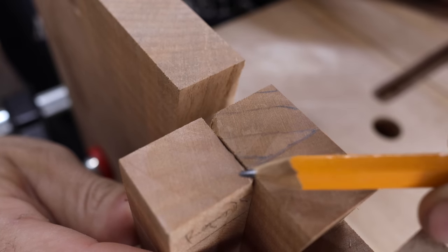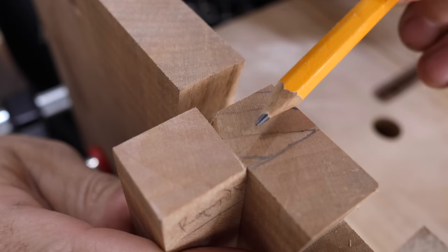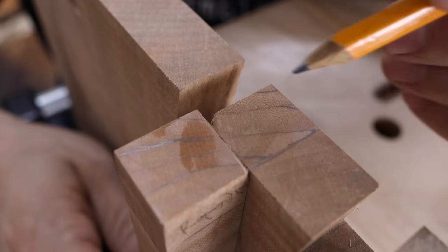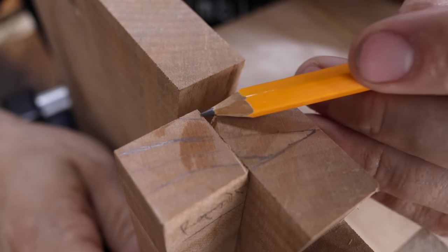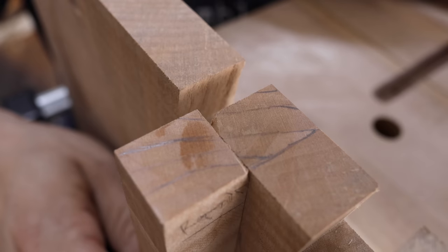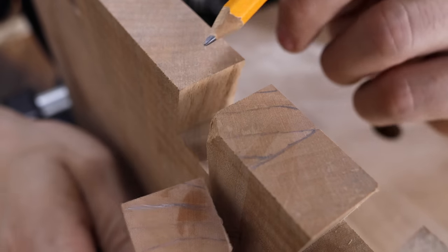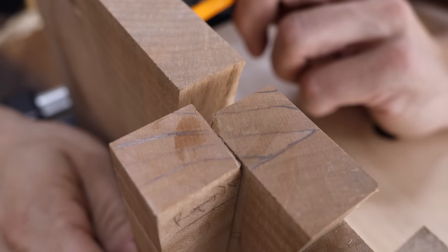Now here's a piece you immediately can tell is the same color. So that's a great start. It's a little hard to see these grain lines, so I'm going to highlight them the same way I did on this piece. Now that's really rough and that could be wrong, but I think it's pretty close. I've got this grain line that should line up pretty nicely and flows through one another really well. And I've got this grain line that's pretty close to a match. That's very close. So between those two things and the color differential being minimal, if not zero, I think this might be our piece. That being said, what I'm going to do is I'm going to clean up this face that's going to get glued on, and then I'm going to clean up this surface where this break actually was and see if we can't get a good alignment of these pieces.